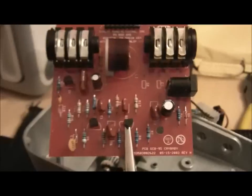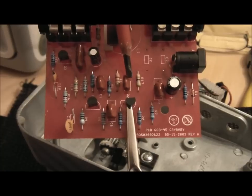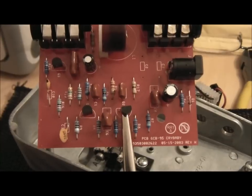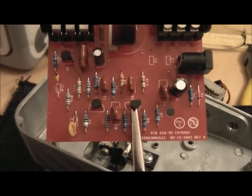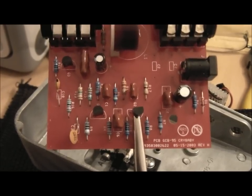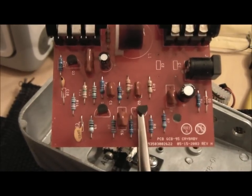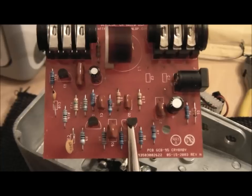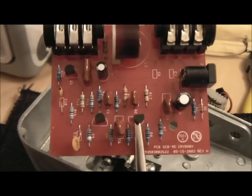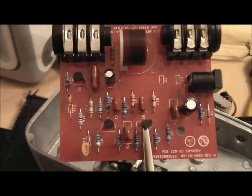oh, what the hell. Also, with this being a Zakk Wylde, this capacitor here is a 0.02 microfarads. Now apparently in the normal Crybaby it's a 0.1 microfarads. Now I've left that in there, and you did send me the stock one, the 0.1 microfarads, but seeing as Jimmy in his pedals they seem to think that he had a 0.02 microfarads, so I thought, oh sod it, if it's good enough for Jimmy it's good enough for me. So that's where we are at the moment, and I'll be back in a second.